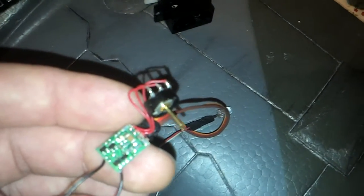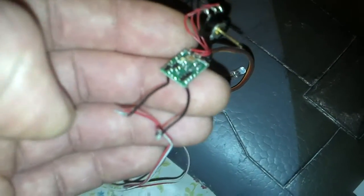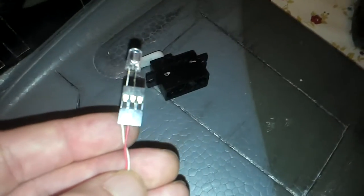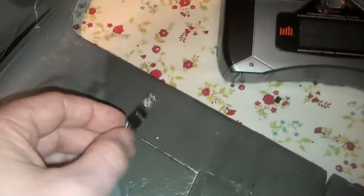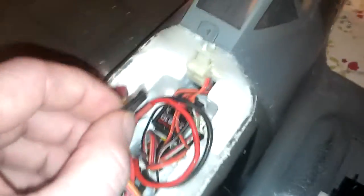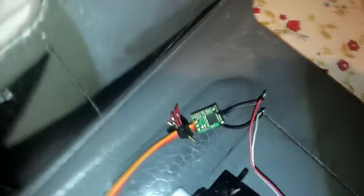I've just quickly wired up some lengthened wires. I've taken the internals out of the servo, centered the potentiometer, wired up my wires to the motor leads, and pushed an LED into the receiving wires that go to the motor. It's as simple as plugging it in.